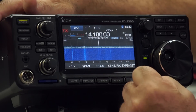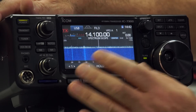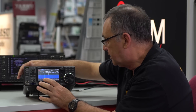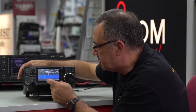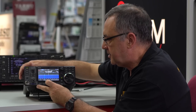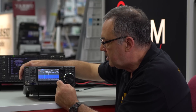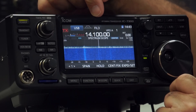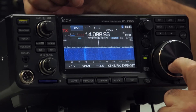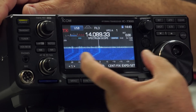There are two modes for the spectrum display. You have the centre mode, where in the centre of the screen — where that vertical bar is — that is the frequency you're going to be tuning to. As you can see, as I tune, the whole frequency display shifts backwards and forwards. With that you can change the span — we're currently at plus and minus 20 kHz. We can do plus or minus 40, plus or minus 80, all the way up to plus or minus 400 kHz, which is quite a spectrum.